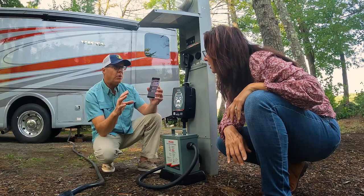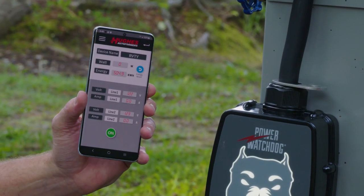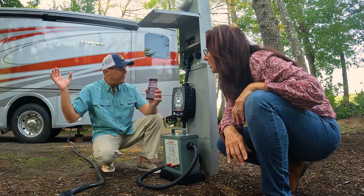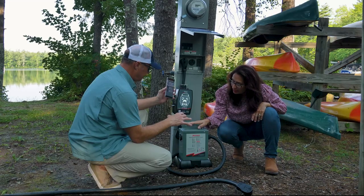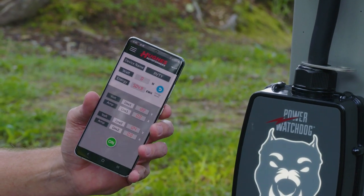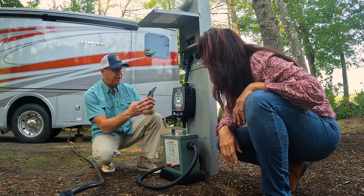What number do you want? We want around 120 to 122. If it's anywhere near 112 or 113, that's very dangerous for your air conditioning motors, your microwaves — all the stuff you've got inside. Everything's gonna get hot if it's low power, and that's when you use the booster. So this tells us we've got good power here at this campground, but you never know around the country what you're gonna get.